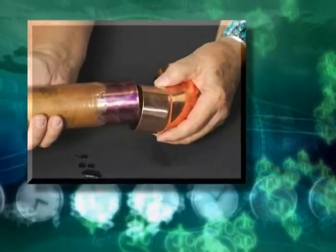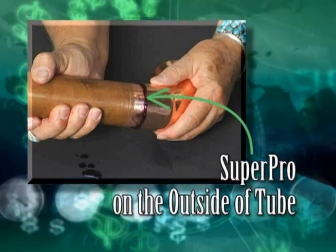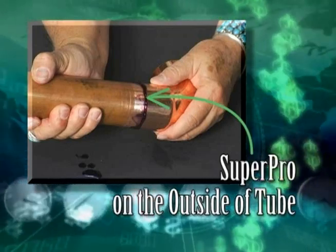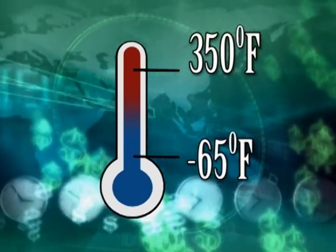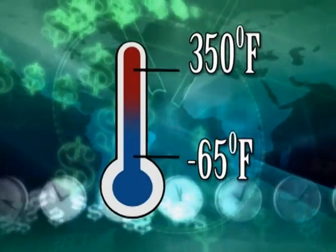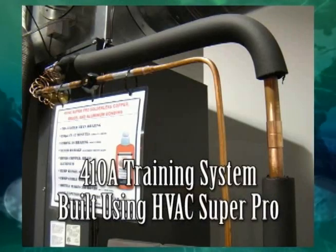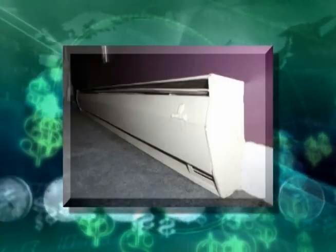The SuperPro on the outside of the tube will not harden and can be wiped off after the 3- or 5-minute mandatory bonding time. SuperPro is anaerobic and only hardens between the connector and tubing. SuperPro has a temperature range of minus 65 degrees to 350 degrees Fahrenheit, which far exceeds the exhaust temperature of a 410A system. The 350-degree constant temperature range makes HVAC SuperPro ideal for all types of hydro-heating systems, including boilers and baseboard heaters.